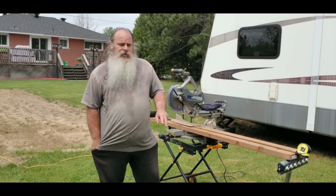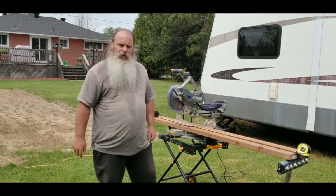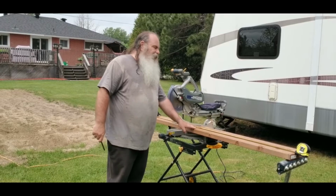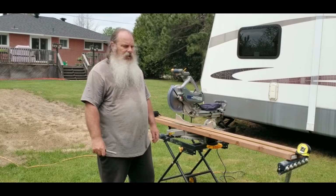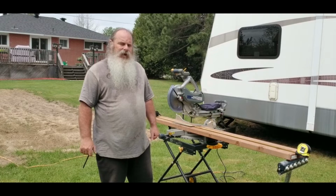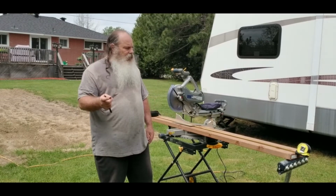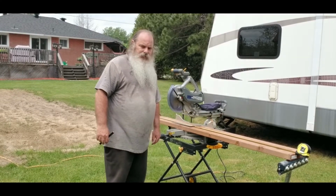I'm going to make two beds, 4 feet by 8 feet. They're going to be 16 inches deep, and then they're going to have a canopy, like a lid, greenhouse effect. So right now I have 4 8-foot 2x8s that I got to rip in half, and that'll be for my end pieces. Then all the rest of my 2x8s, 8-footers, are actually 8-foot, ½ inch. So all the rest of them, I'm going to trim a ½ inch off to make it square. So right now, I'll rip 4 of them in half, and that'll be my end pieces. Be right back.